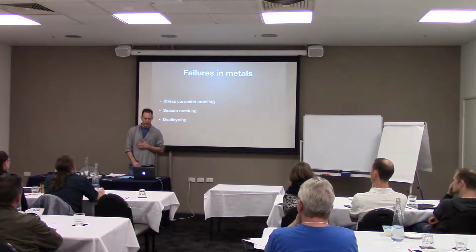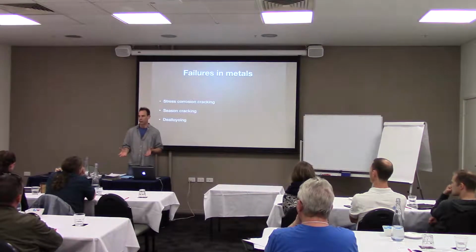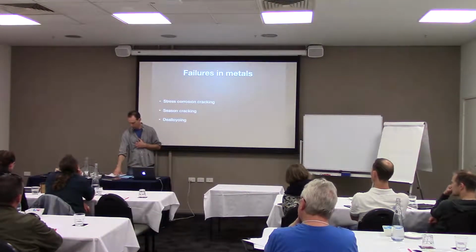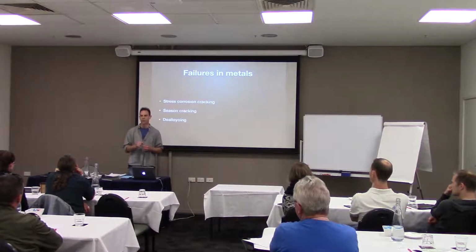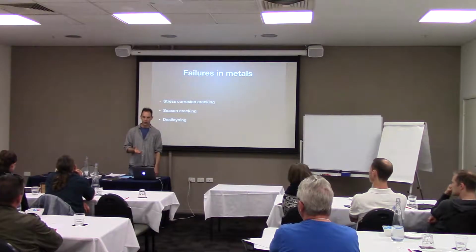Season cracking. This one's interesting, and I think this one affects us more than any other thing we could do to the metal. One thing I really worry about is ammonia. It's in brass cleaners, they sell it to clean up brass, and we're exposing the grain and the boundaries to this ammonia. Ammonia decomposes organic matter, which is what we're blowing through the horns anyway. What ends up happening is it starts to attack the softest point, which is the grain boundary, and then it starts to separate. That's when we have to be careful. Coming through repair, studying with different people, I've heard people recommend spraying with Windex after I've soldered, because it cleans it up. And yeah, the ammonia is great, it just attacks the crap out of your metal. So I would avoid using ammonia if you can.